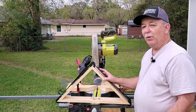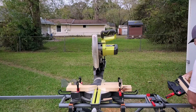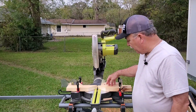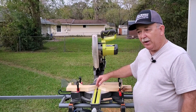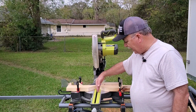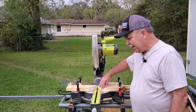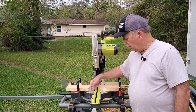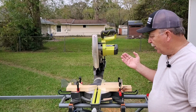The first video that came up was so simple I just couldn't believe it. All it was: you lay a board — in this case I used a scrap two-by-four — clamp it in position, cut a 45-degree angle here and a 45-degree angle here. This is zero degrees, so this is 45 and this is 45. If I wanted a steeper angle than 45, I just had to move my table in the direction I needed, count the angle marks, and add them to 45. It's just so simple.